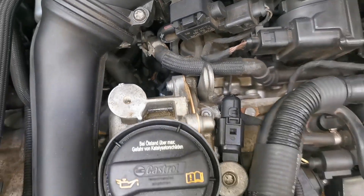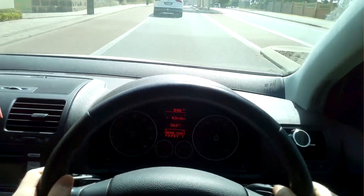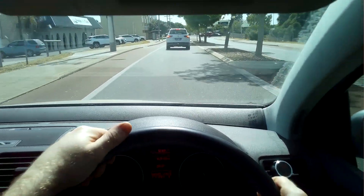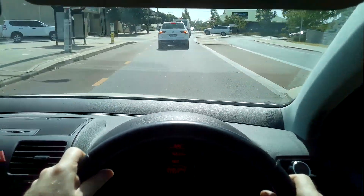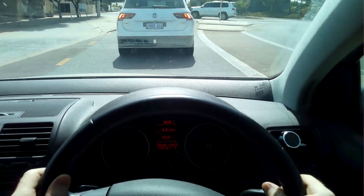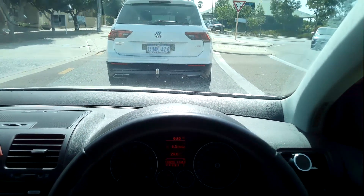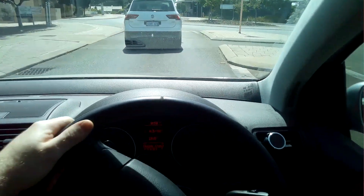With it all put back together, it was time to bring it for a test drive. I'm on the final road test now, doing an extended one, making sure we have heat throughout the cabin and circulation of the coolant is exactly where it should be. Also making certain the performance is correct, no engine lights come on, and double-checking all our work. When you do an extensive job like this with multiple pipes, components, and connectors removed, it's always advisable to do an extensive test drive.